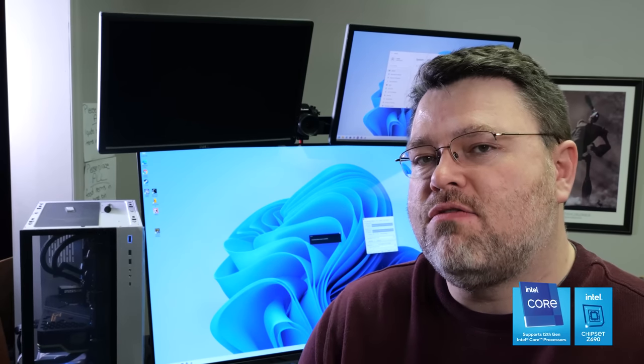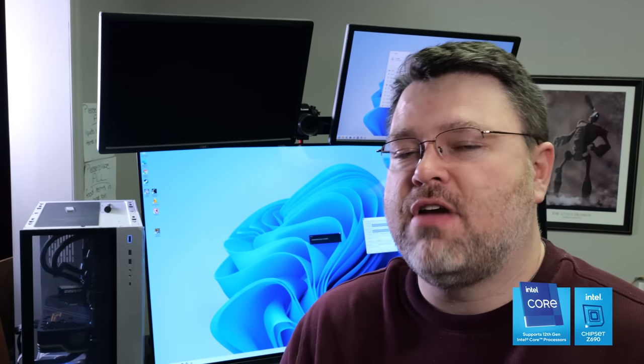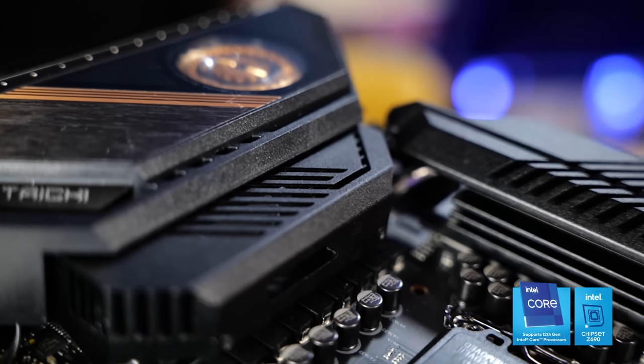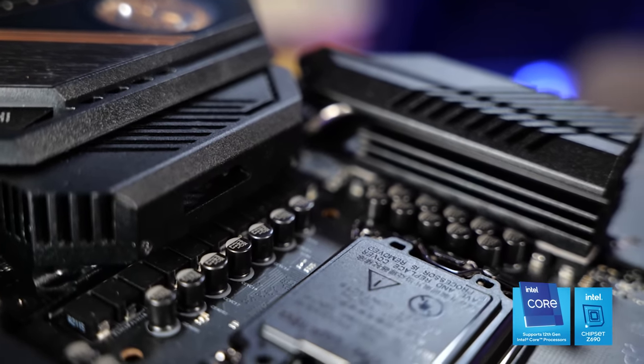I was a little worried about airflow over the motherboard. Maybe I would need to add another fan in the top or something with a 3D printed duct, but the ASRock has a built-in VRM fan, and that seems to do the job here. I didn't even need to use the extra VRM fan that came in the Taichi motherboard, which is nice.